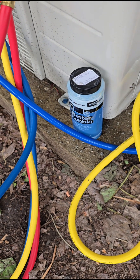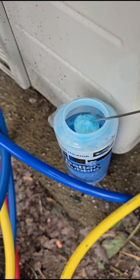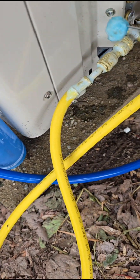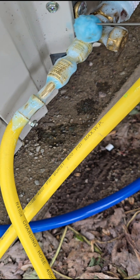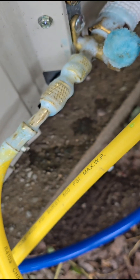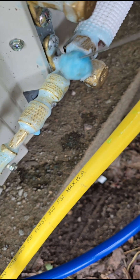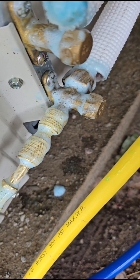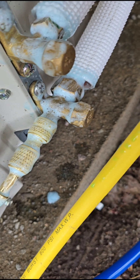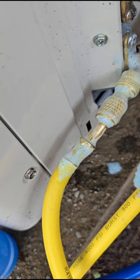We use Better Bubbles to test for leaks. You want to completely dry it out first — you don't want anything in there. See, even after 40 installs, there's still a lot in there; it's basically brand new. You don't use much product. You just get it all off the brush, rough it up, and make bubbles. You want the bubbles applied so that any escaping gas has to penetrate through them. Just apply it everywhere there could possibly be a leak — you don't need to keep dipping back into the bottle. One application gives you more than you'd ever need.